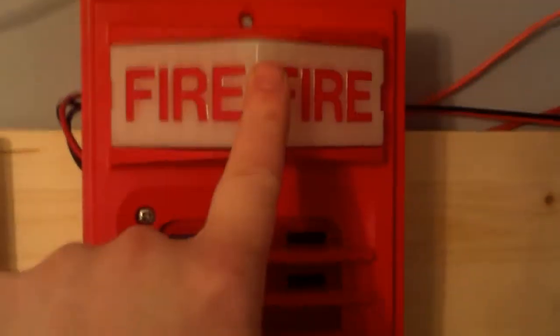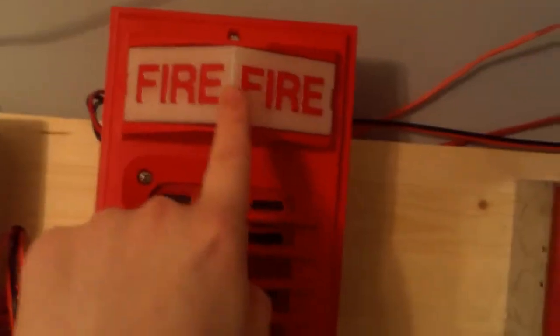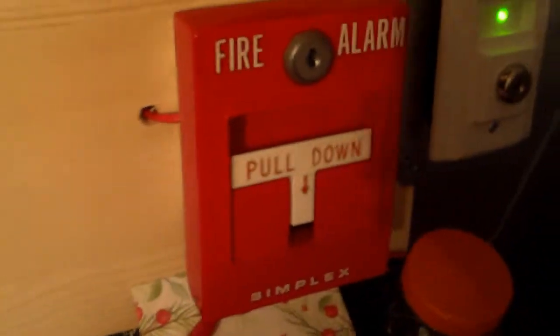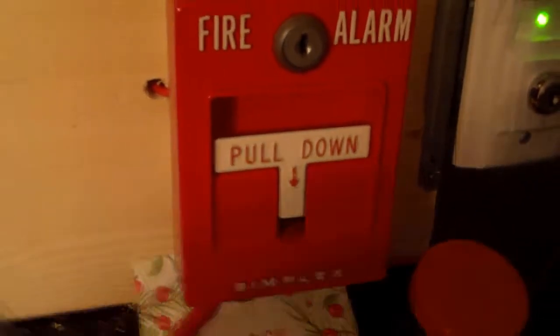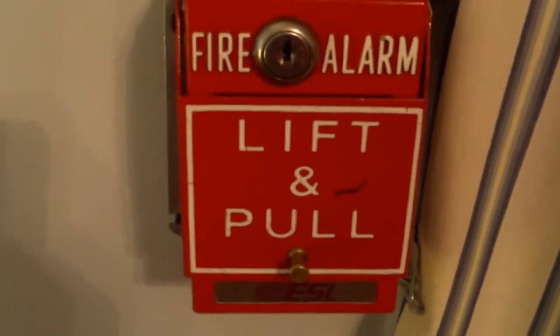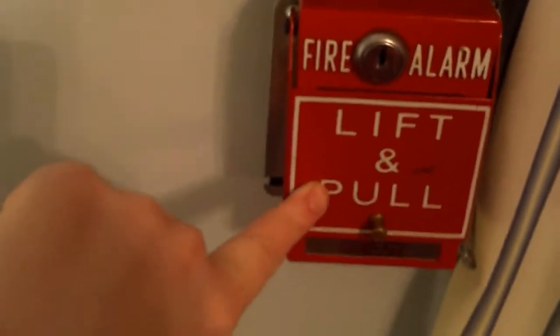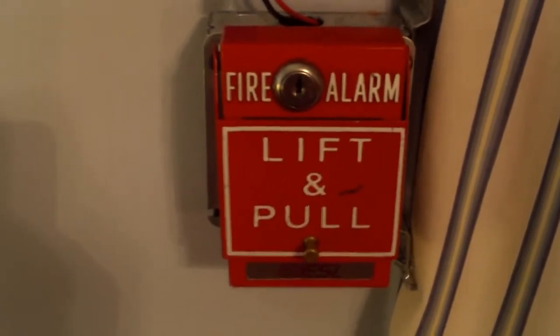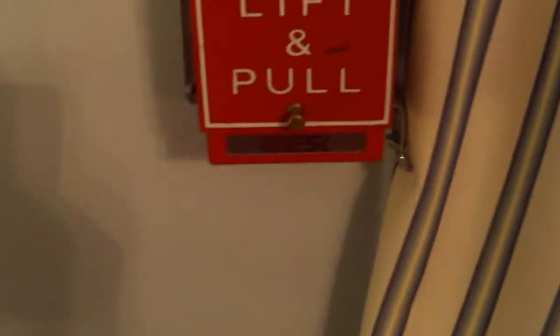As I said, I do have the light and the strobe on the NACs connected to the strobe circuits, which will be doing audible silence. And down here for the first conventional pull station, he requested the Simplex 4251-20. And coming over here, he requested the Powertronics MSMKD, but I just have the RMS1T still up because it's basically the same thing as the Powertronics MSMKD.